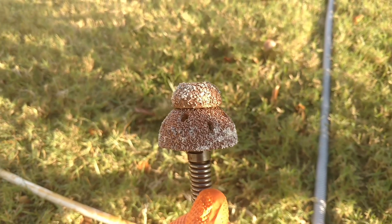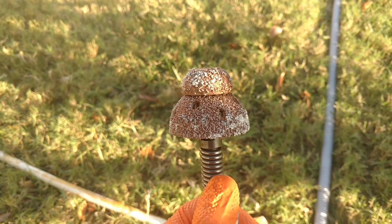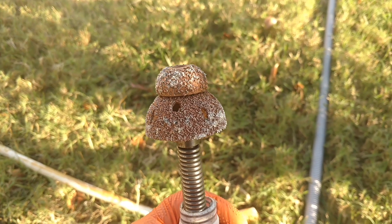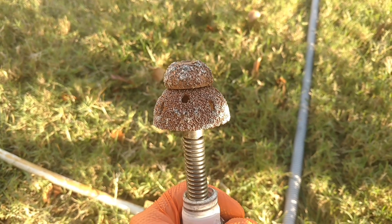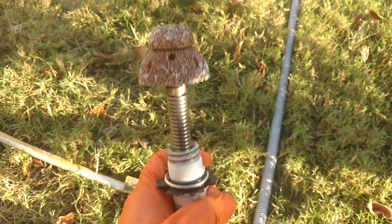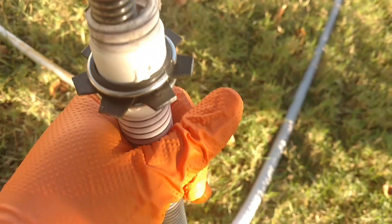It's actually working pretty good. We're getting a feed rate with just the right amount of pressure at about an inch per minute. But the thing is, we've got to play with the pressure. You do too much and you start bogging down the drill. You do too little and it just kind of stays there. And that's off of a Rigid Mini — that's a star skid for a Rigid Mini — and that's working really well.